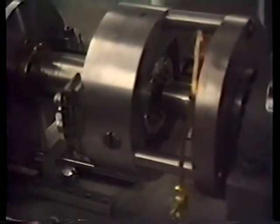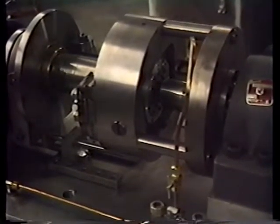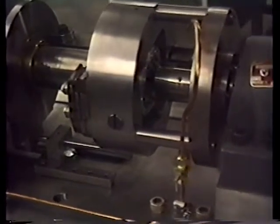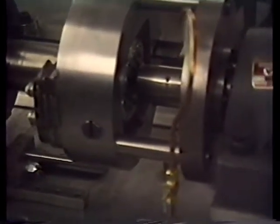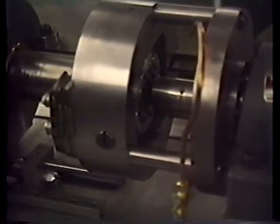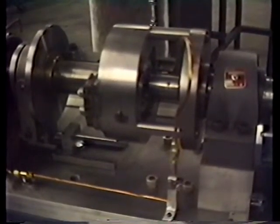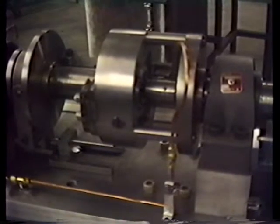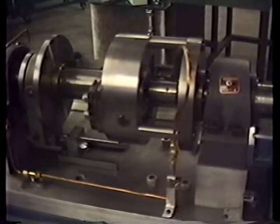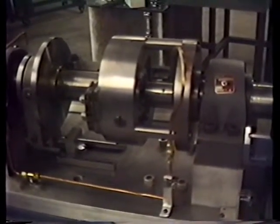We're looking at the forming head now, the part of the forming head where the dies are mounted. The rods that go out into those forming dies are the guide rods, and they have inserts inside these guide rods that allow it to change from one diameter size to the next. This machine will form corrugated tubing, this particular design, from 1/4 inch up to 1 inch.